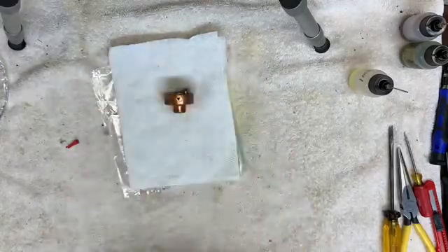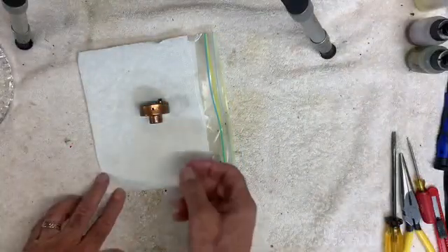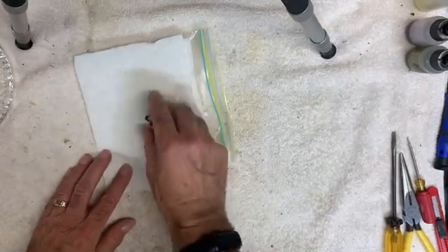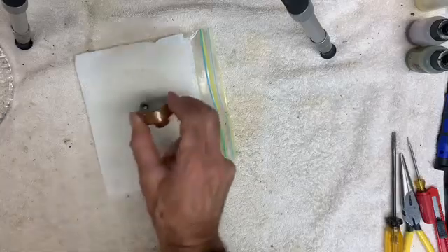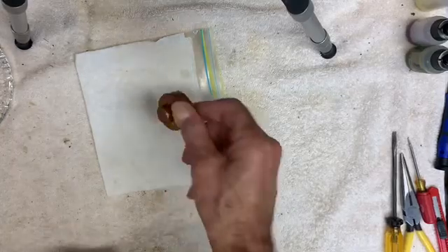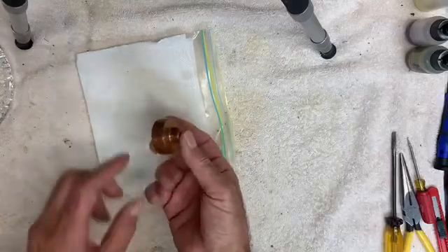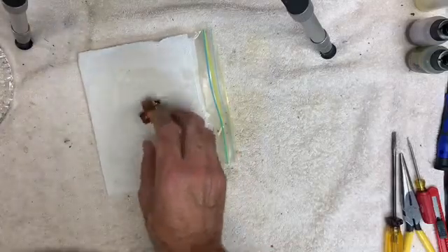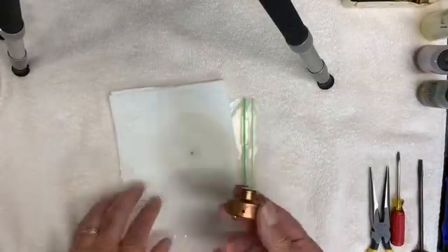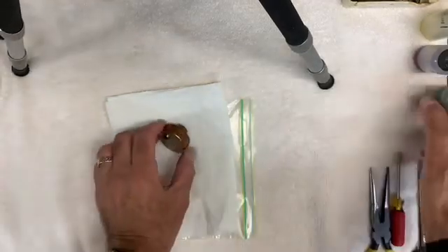This has been draining now for a few hours — a little bit of it has leaked out, it's about as empty as I'm going to get it. The next step is to fill it up again, this time with three-in-one oil: same procedure, put some in, give it a shake, fill it all the way up. Let this sit for about 12 hours — it's not as necessary to give it a full day the way I did with the liquid wrench. After 12 hours, shake out the oil, then turn it upside down for another couple of hours to drain out the excess.